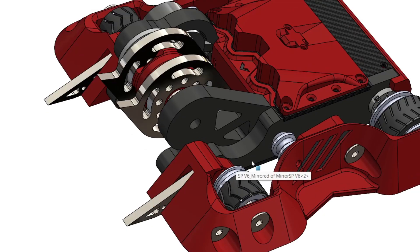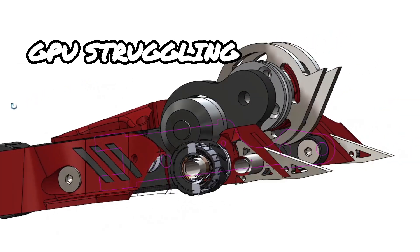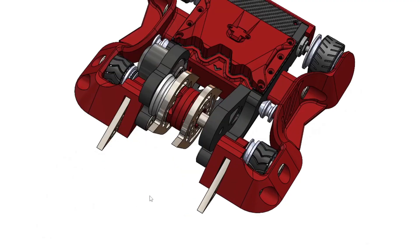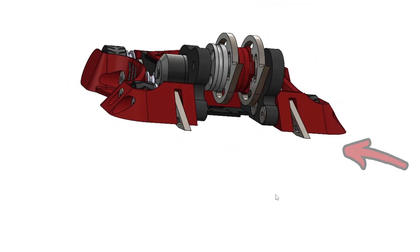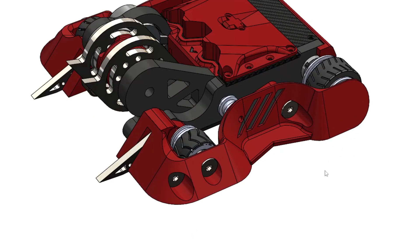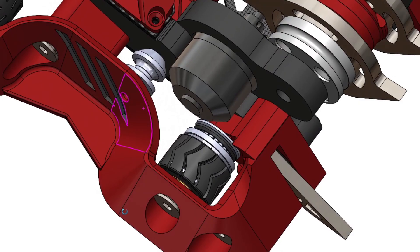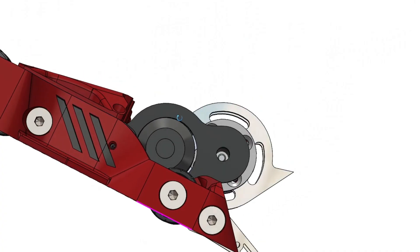Between V1 and V2 there was a pretty sizeable gap, and in that gap I continued iterating on the ant weight. The plan for V2 was to migrate changes from the ant weight to the new beetle design and address issues from Champs 2023. First off, the side armour is now TPU rather than HDPE and shares the same skirt design as the ant weight. The sloped design can help deflect impacts, making horizontal hits more likely to glance off, and it makes the robot slightly wider to bear against when the robot gyros — stopping it from being prone to flipping over like V1.